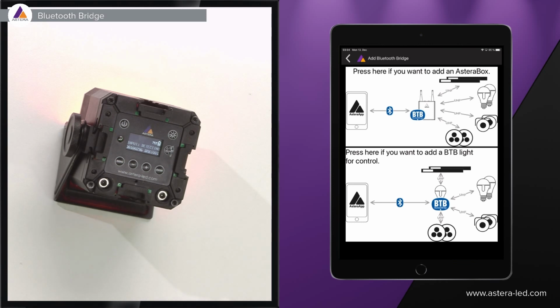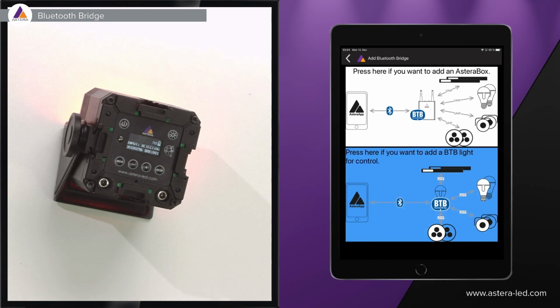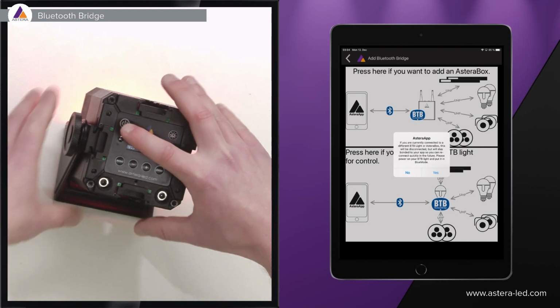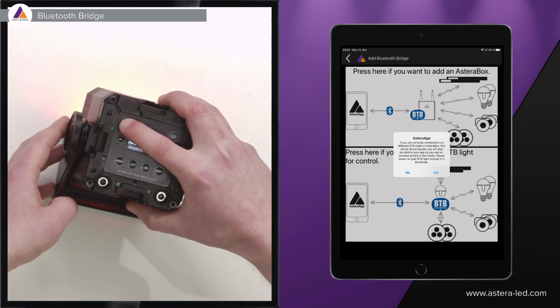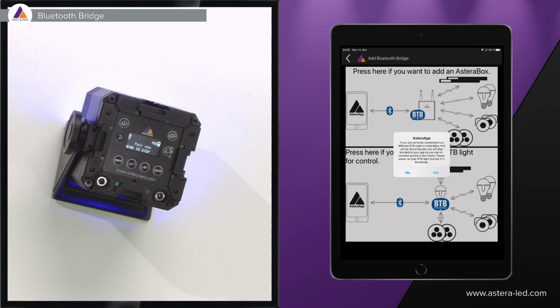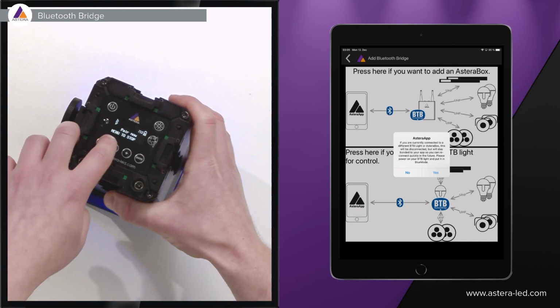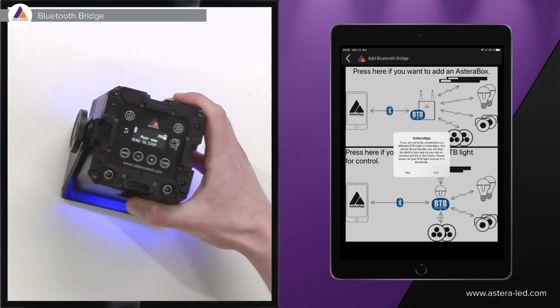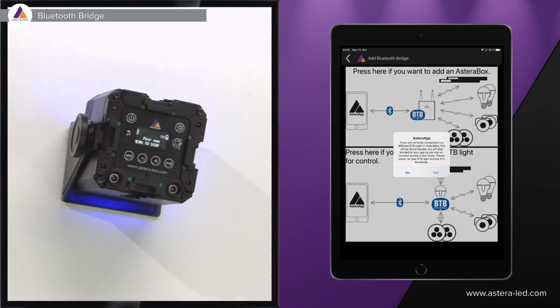Here it asks you if you wanna add an Astera box or if you want to add a BTB light for control. So we are just choosing the BTB light for control. This little info box is just asking if we have blue moded the light, so we also activate the Bluetooth. That's basically done by holding down the power button for 3 seconds until it blinks blue. As you see in the display here, a little Bluetooth icon pops up and means that the Bluetooth module is active. So now in the app we can press the yes button.